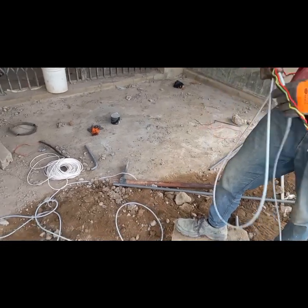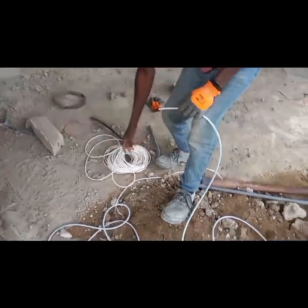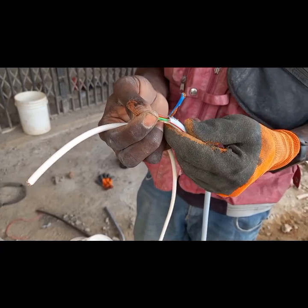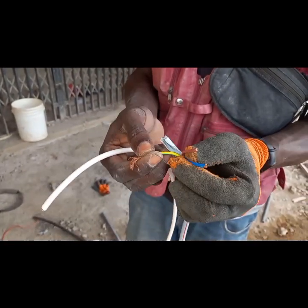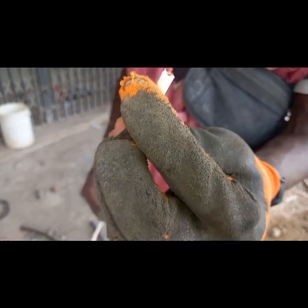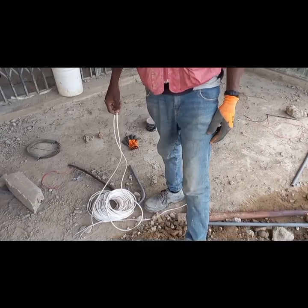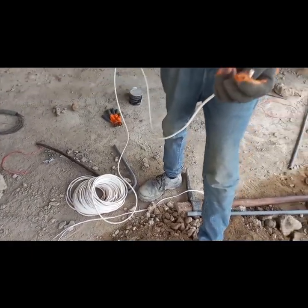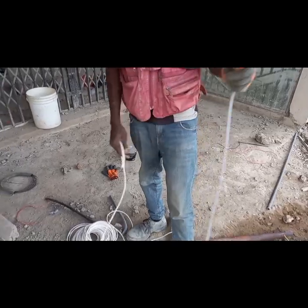So it's right to use the appropriate cables. This coil flex cable can be used almost everywhere. We have sizes — this is a 1.5 millimeter square cable and it's a 3-in-1 coil flex, meaning 3 conductors in 1. And this is a 0.75mm 2-in-1 coil flex, meaning 2 conductors in one cable. We have up to 4 of them in one cable — you can get 2-in-1, 3-in-1, and also 4-in-1.